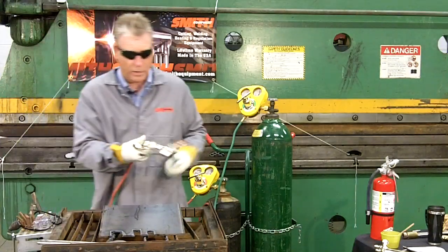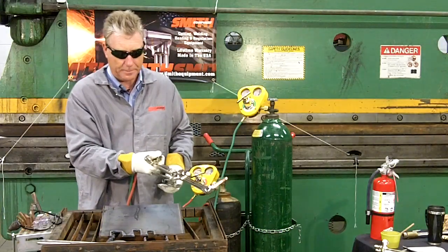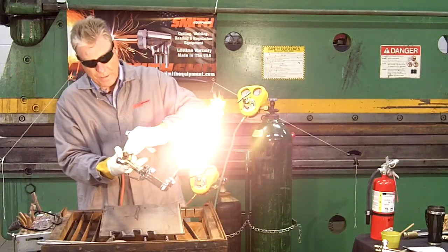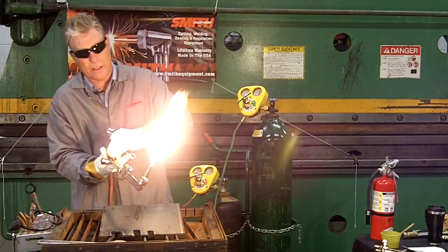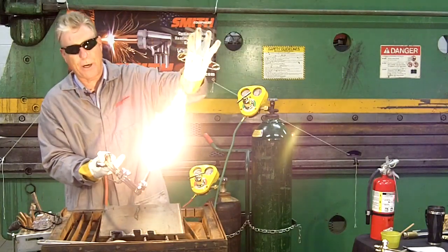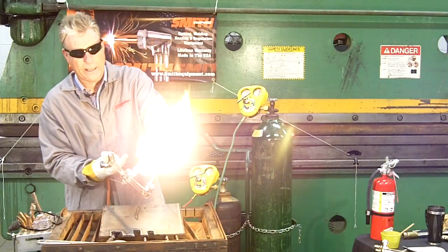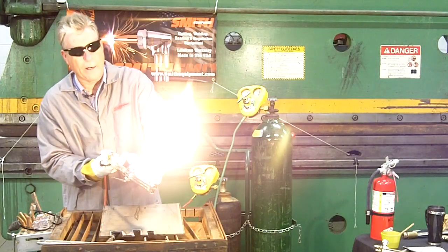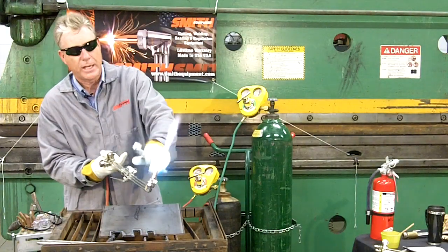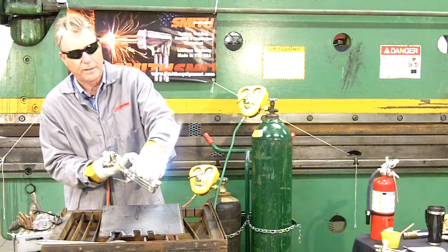With my friction device in hand, open the acetylene valve about one-quarter turn. Open this acetylene valve until the flame is quite bushy — that black sooty look has disappeared primarily. At that point, we will now open our preheat oxygen valve, the forward valve, slowly adding oxygen to make a neutral flame. As we add oxygen, the long flame becomes shorter and will match up exactly with the preheat flame.